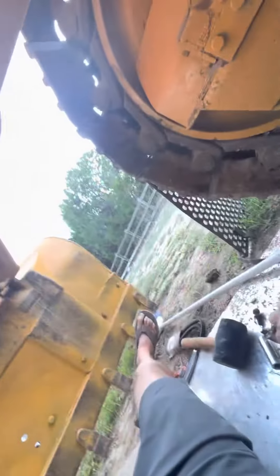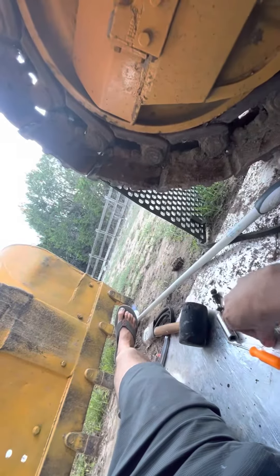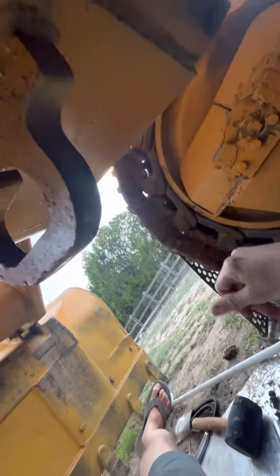There are four bolts that hold it in — these right here. There are retainer rings on the pump side and on the crankshaft side. If you're going to do this, especially if your tractor's been sitting for a while, get some PB Blaster and lube that shaft up.